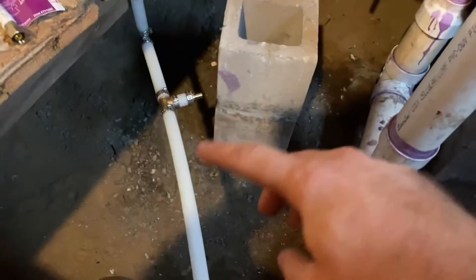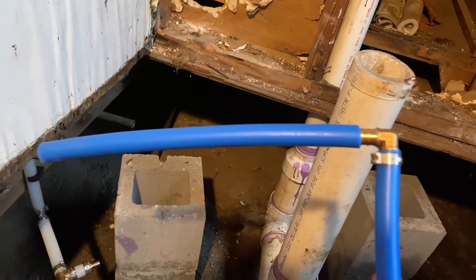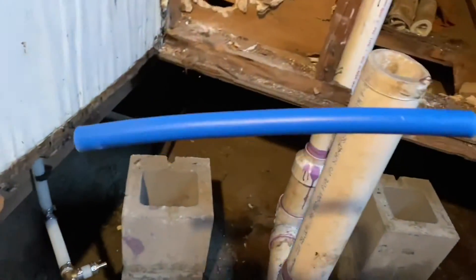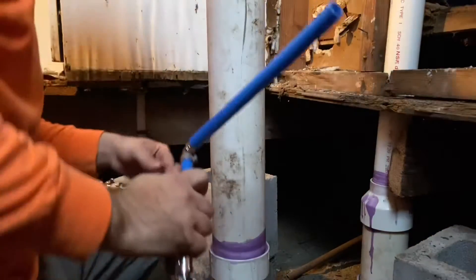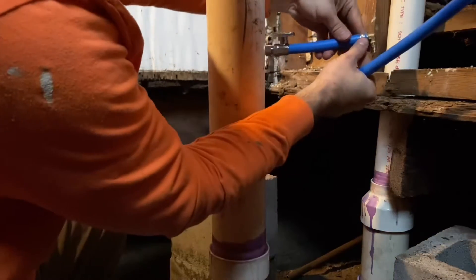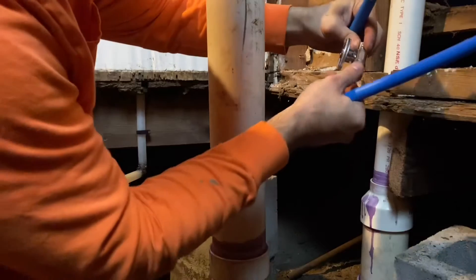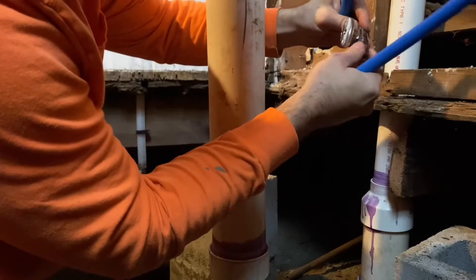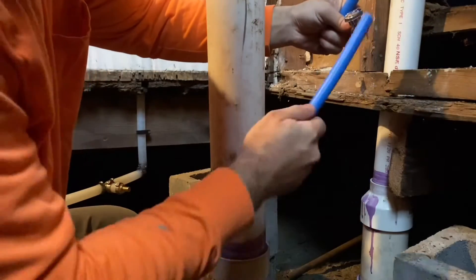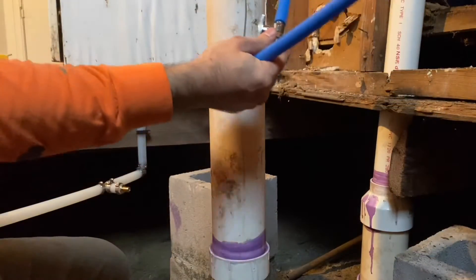From the main line we need to branch off and make a toilet connection. Here's the toilet connection - all I have is a 90 and a short strip of pipe that I'm cutting off this big roll. I've measured it to length. I've already pre-crimped this 90 on here. I'm going to take this off so you can see how easy this is - this is a shut-off, and on this end is a little nut. I'm going to take that off because I don't need that part.